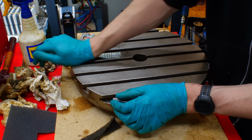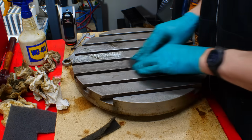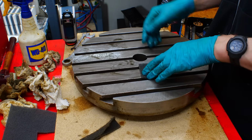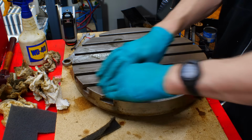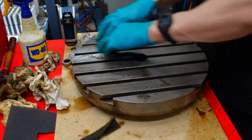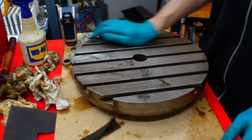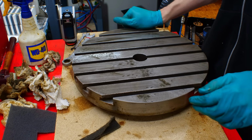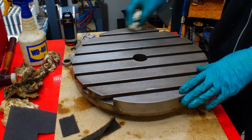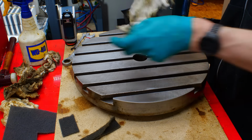So if you buy an old FP1, you will often find a lot of unused tooling in the accessories cabinet. It seems that very often the machine got sold with the entire accessories package, including the rotary table, slotting head, high-speed head. But the machine was set up with the vertical head and a rigid table, and it stayed that way for its entire duration in the shop that it was purchased for. Happened at my day job very much. So many of the accessories are often in good condition. You have to be careful what they were used for, and look out for rust.